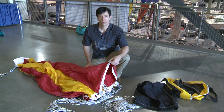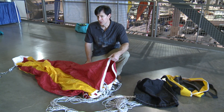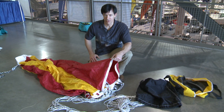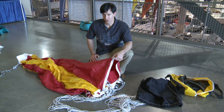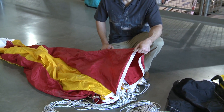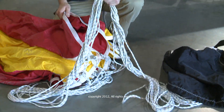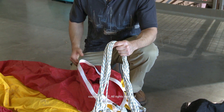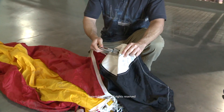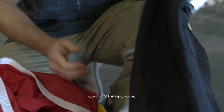This is an Australian parachute sea anchor. They have many different models, and this particular model is specifically designed for sailboat offshore use. They're using a nice thick Dacron fabric on this chute. In reference to shroud lines on this 15-foot diameter chute, they're only sewing 12, versus the Fiorentino which has 24 lines sewn to their parachute. Their swivel setup is similar to the figure-8 swivel, so it's going to likely have a tendency to lock up on you when in use.